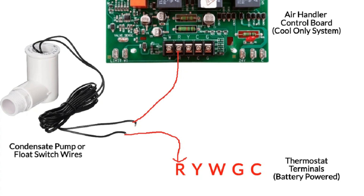Basically what this does is: if we have a water condition where we're not getting drainage and the water is backing up, the float switch will activate and it will not allow the 24 volts from the control board to make it to the R terminal on our thermostat. If our thermostat can't get 24 volts on the R terminal, it can't send out a signal on cooling or heating. And we don't want our system to continue generating water when we have a water problem. Now 95% of the time, this is a perfectly acceptable way to do it — in most circumstances, it's usually the best way.